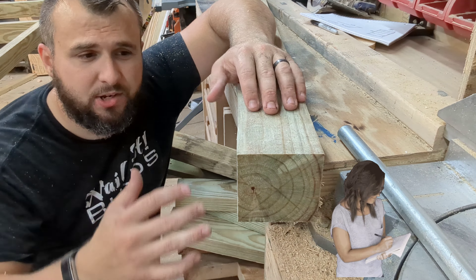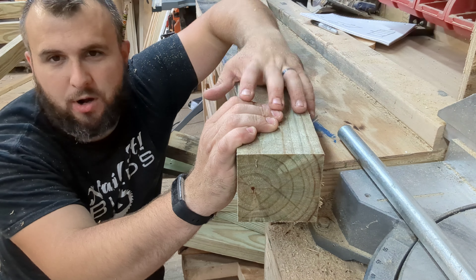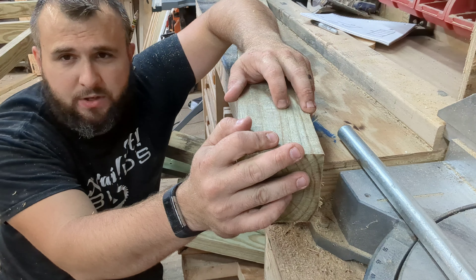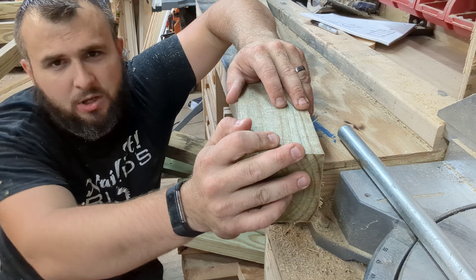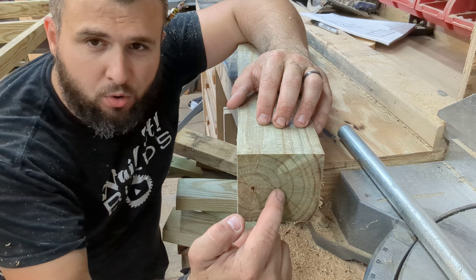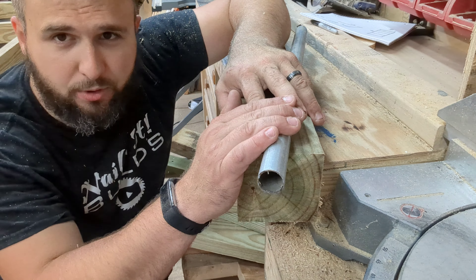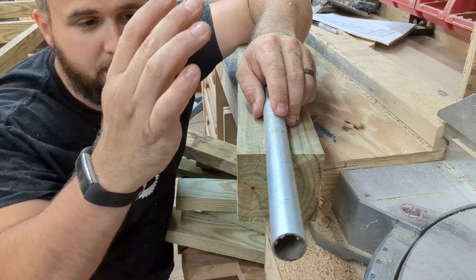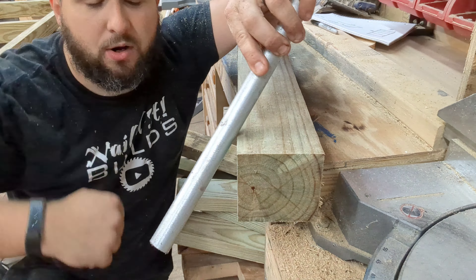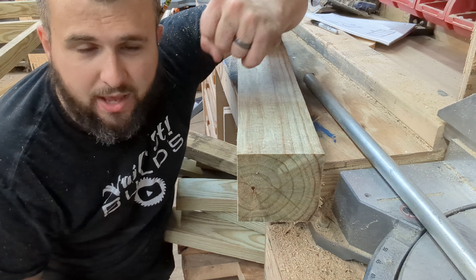Technically I'm combining two posts to make one solid post. Being the post by the handrail, people are going to grab it a lot more, and it'll have the arm coming off it, so it needs to be strong. What I'm going to do — you can see I have this X here in the center — I'm going to do the same on the post out on the deck. I'll drill a hole in each one and put a piece of conduit in there, about four or five inches on each side. Centered properly, that section of conduit will really help reinforce it, and then I'll glue it and do a bunch of toenailing. That's how we're going to make that a solid post.